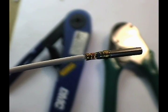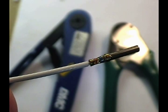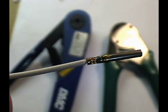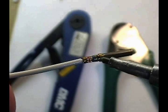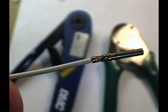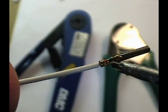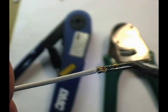This is a socket which has been crimped with the tool on the left — the high quality crimp tool. Notice the inspection hole, which allows us to verify that the wire has been inserted deep enough. That hole is right here. You can visually confirm that the wire has been inserted the depth of the connector after the crimp. Also notice that there are four indents around the circumference of the pin.